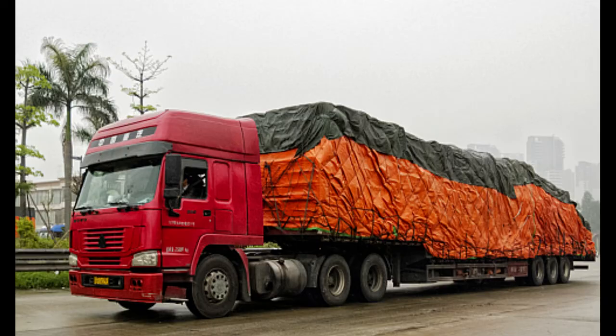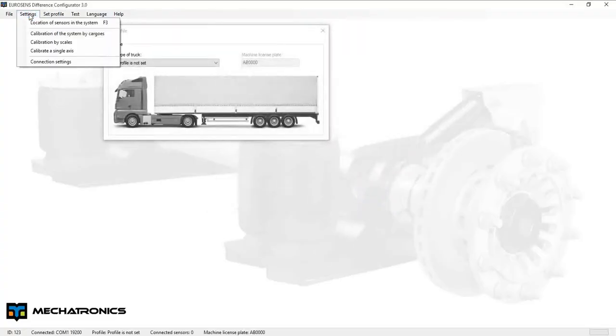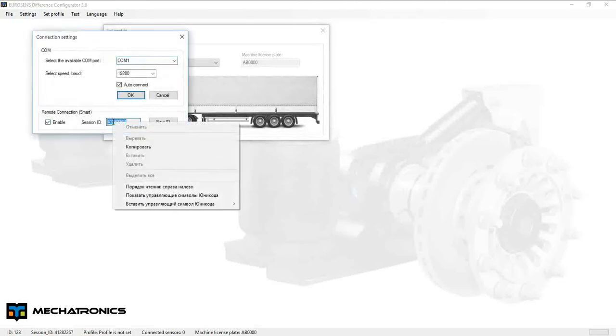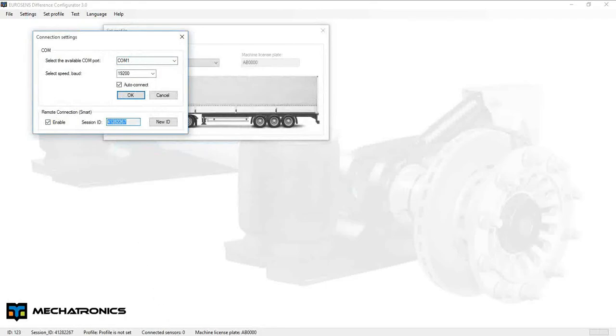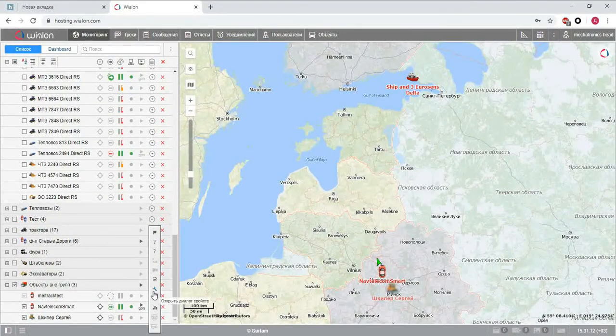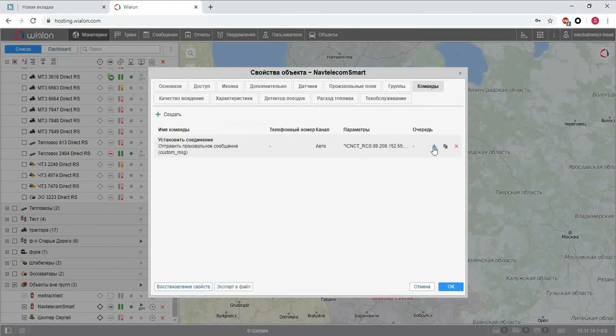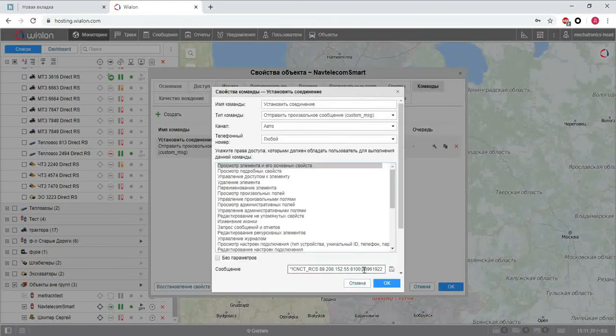Some days later, the truck will have some cargo on board to add a new point of calibration. Open Eurosens Difference configuration software and choose remote connection. Copy the ID number of the session. Send the remote connection command to the smart GPS tracker by GPRS or SMS. The format of the command you can find in the description of this video.